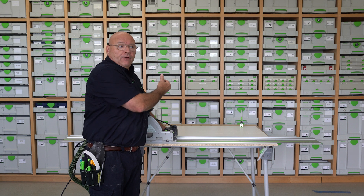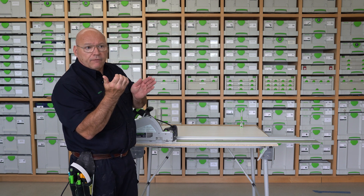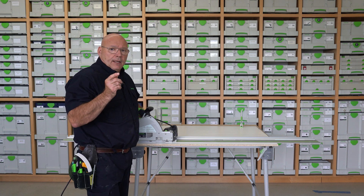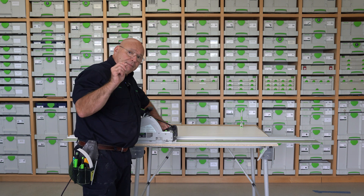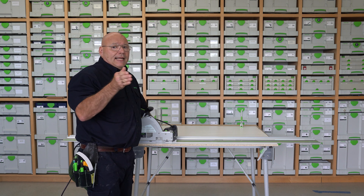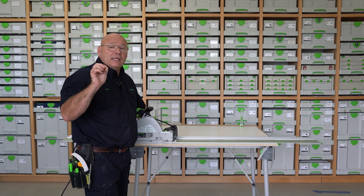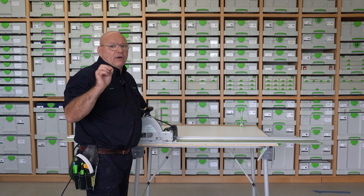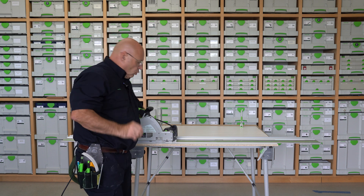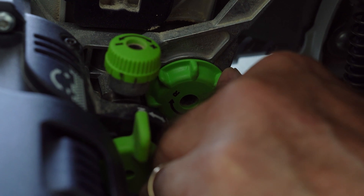If it was off on the other side, R means to the right, going out that way. The dial back here has 20 clicks on it — the depth setting was very fine at 0.1 millimeter, and each side-to-side click is 0.025 millimeter. It's a super fine adjustment. I'm going to adjust it a few clicks and check the cut again.